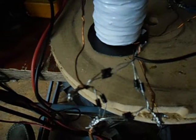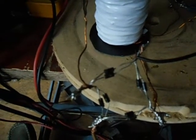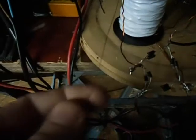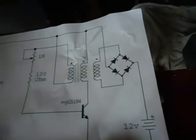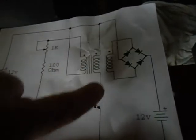There is a coil here with, I think, a gauge, well, it's probably 18. I did about 30 meters of one wire and another wire, same, maybe 20 meters, and also two sets of small wire. One is not used and one is the trigger wire. Now I'm using the two thick wires, one as the primary coil and one as a generator coil.